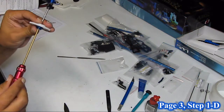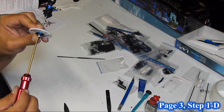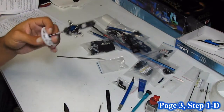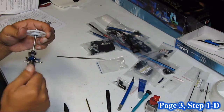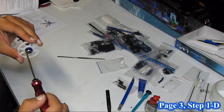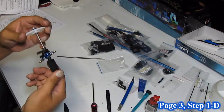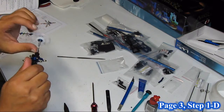Get that pulled down evenly. Ideally you want to have these screwed down such that there's no perceivable gap in the one-way assembly between the upper and lower sections. Sometimes if it's a little bit tight to begin with that's going to be okay — it will actually work its way in. Other times, loosening these up just a little bit tends to reduce the captured friction. That's probably about as good as it's going to be for right now.